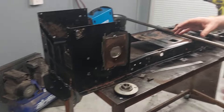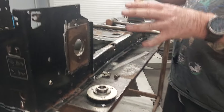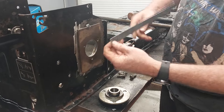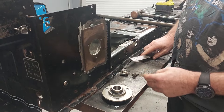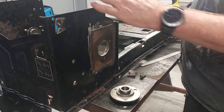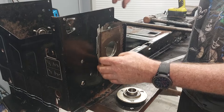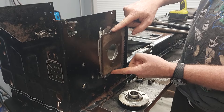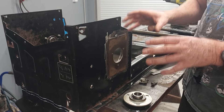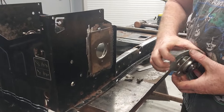We had the small hole here which we'd set up for the right height. I then re-measured the holes to make sure they were the same distance on both sides, then I took the steel plates and put them on here. I used an engineer's square, made it square, measured the distance, and then tack-welded it in place. I did the same on the other side, making 100% sure that we're sitting level and straight.